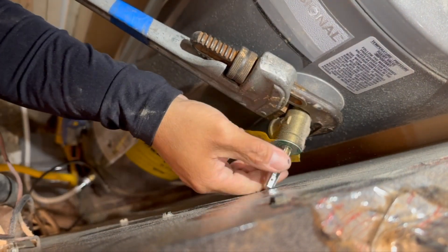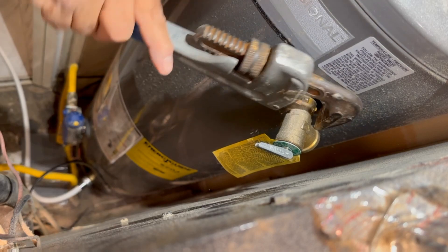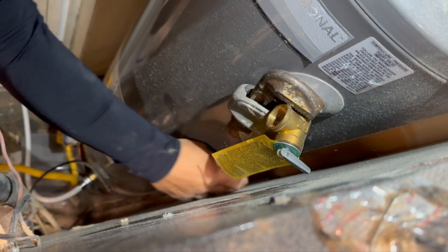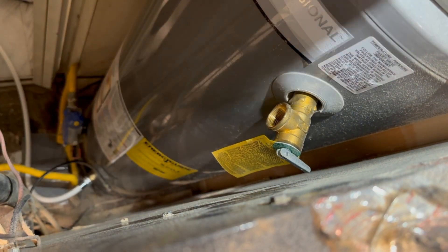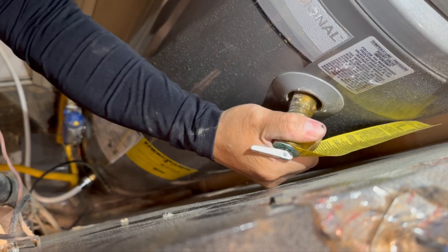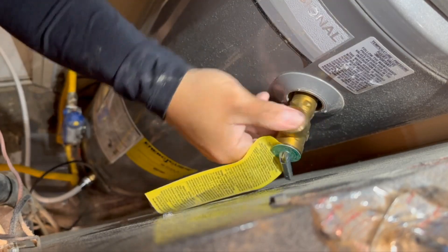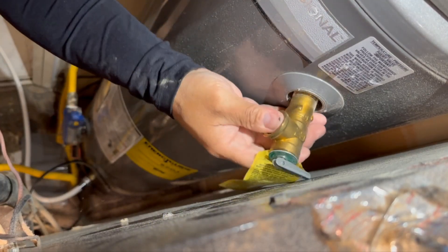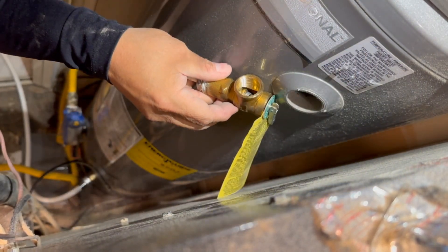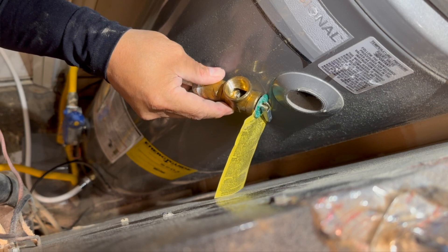It's draining good. I want to test it — just exercise the valve opening itself. No water came out, so the water is already low, but just to be on the safe side I'm going to keep draining. Water's a little warm — they were probably using it. I was a little scared of the gate valve, it's kind of old and very stiff at first, but I didn't torque it down to close it. I left the hot water at the tub open. There's the spring inside that wears out.